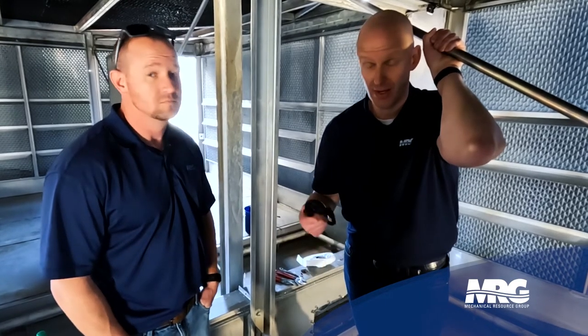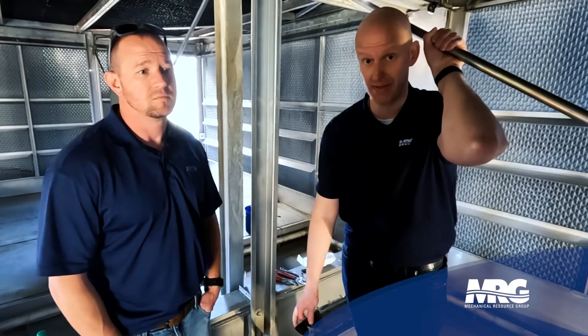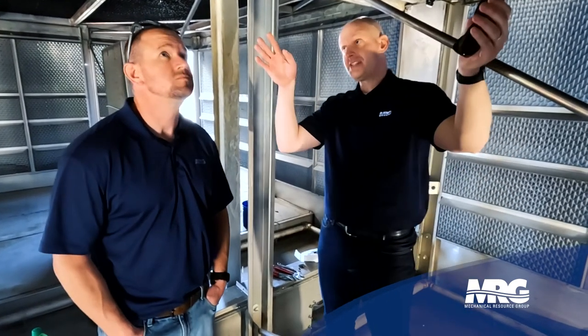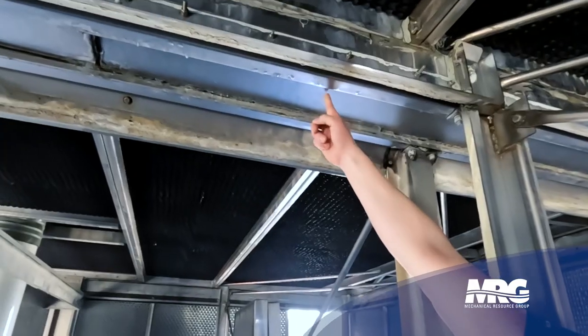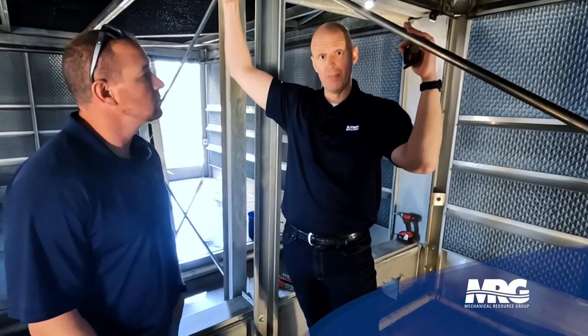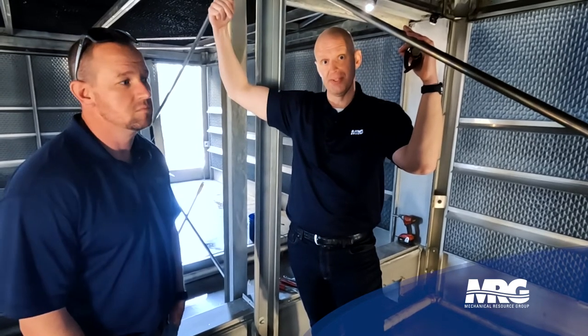Setting cooling towers properly during rigging is really important. It's a really common mistake — almost every tower that leaks, 90% of the time the leak is due to some kind of rigging misalignment. On a tower this long you probably need at least six guys working on a crew to set it. This would be one cell and this would be another cell — you can see they have removable plates designed to give you access to the hardware and bolts to bolt things together at the flange. We love talking about cooling towers — hit that like, hit subscribe, and come back and check us out on Mechanical Pros.